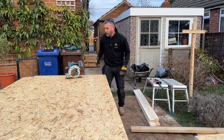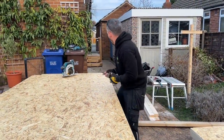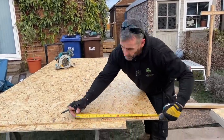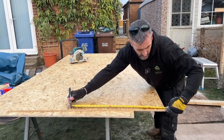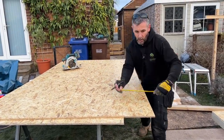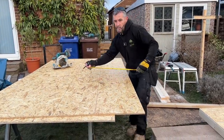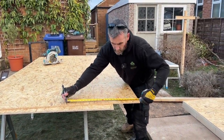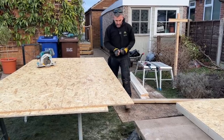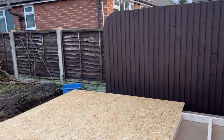I've explained why I'm sending it through like that. I want this edge to be my right angle going over there. So I know my width of board plus 90mm, and I'm going to mark that down there for the cut. I'm also going to mark my 400mm center for the timber so I can nail to the center stud, and mark the center of my last timber — once the board's on top I can't see the uprights anymore. I'll also mark the board to length and cut them all off at the same time.